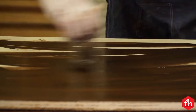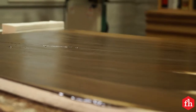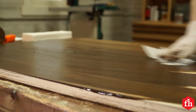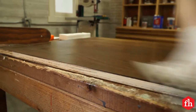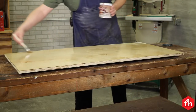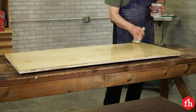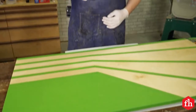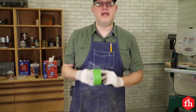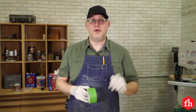I used the same stain and finish for the bottom of the board. Before adding any colors to the top of the boards, I wanted to seal it with shellac. Now that the shellac has dried, I applied the tape to create my pattern. I used frog tape — this stuff is great. You seal the edges with water and it creates the most crisp line you could possibly get.